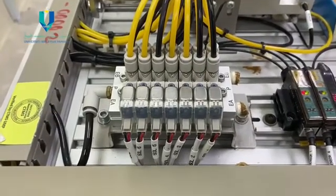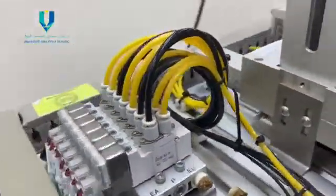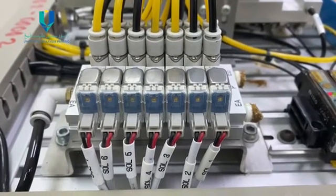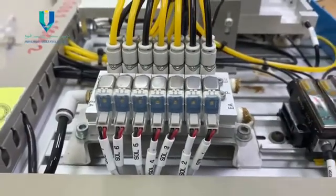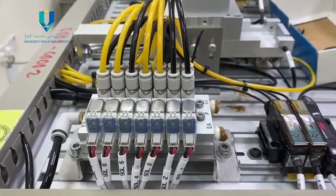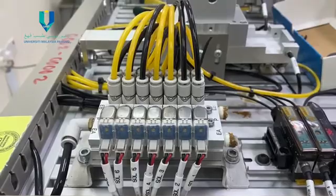For the device output, we have the solenoid valve. Solenoid valve function involves either opening or closing an orifice in a valve body, which either allows or prevents flow through the valve. A plunger opens or closes the orifice by raising or lowering within a sleeve tube by energizing the coil. Solenoid valves are also opened and closed via a solenoid activated by an electrical signal. They include all types of flow paths and proportional solenoid valves.